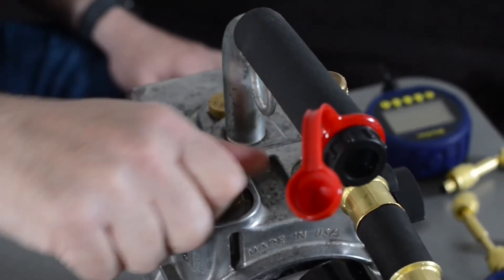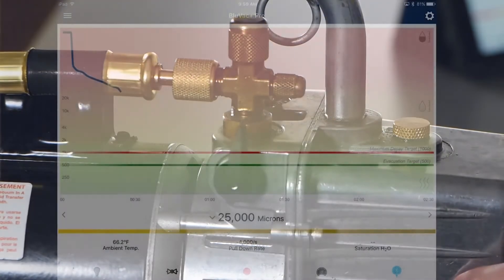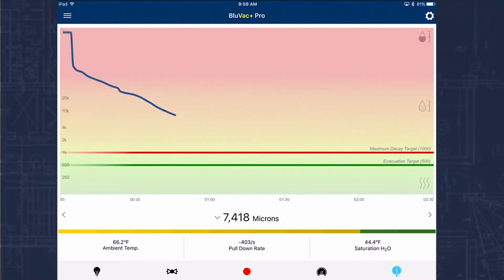I have the gas ballast closed, my valves open on my core tools, and I just need to open up my pump. We're pulling down right now — you can see that's coming down pretty quickly. If we go to our progress indicator you can see we're in our third stage of roughing vacuum. The pump is getting into a deeper vacuum and getting a little bit quieter, but at this point we're making really good progress. We want to go back to our graphical display — look at that, we can see the plot as well.